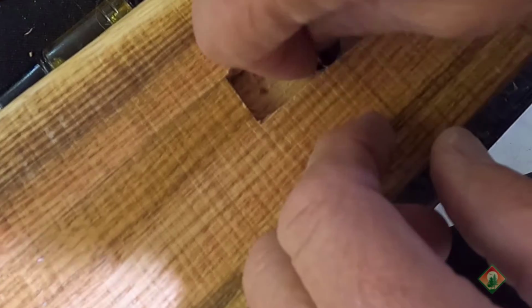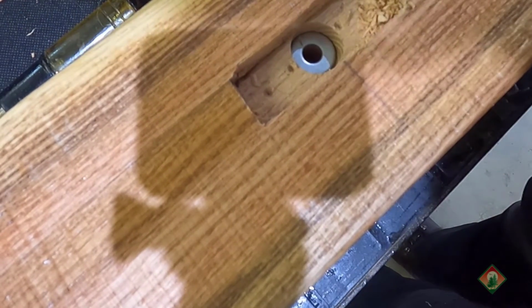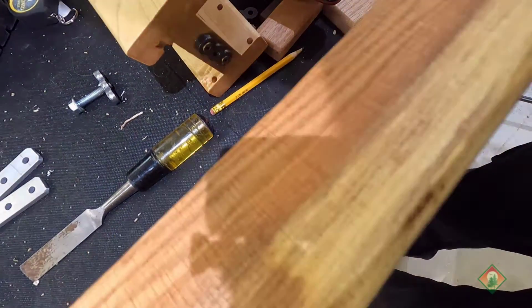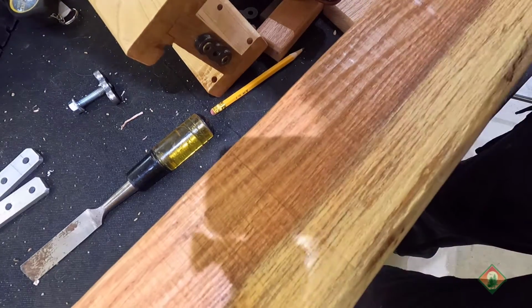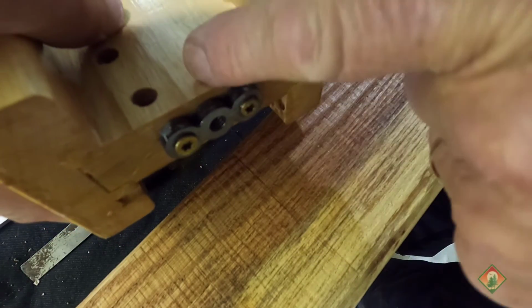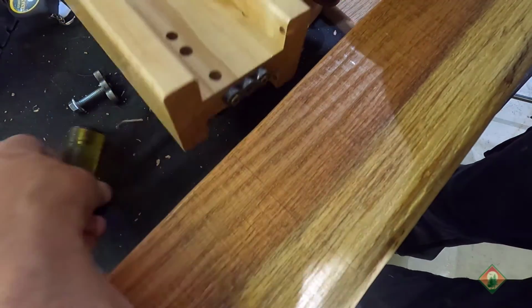That was part of the design of the hole size, to make sure it's large enough for that type of hole. And then there's my bolt, and I can tell it's going to make it because it bounced off. Actually, that's my dog's bed. But now I can see all that material sticking out. And that's why, if you recall, when we mounted these, we drilled a 3/8 inch hole that went in a ways to accept that additional bolt that's going to be in there.